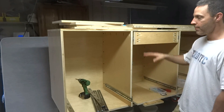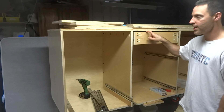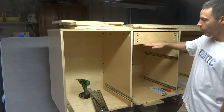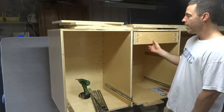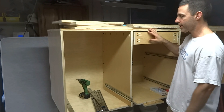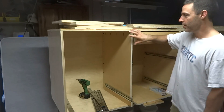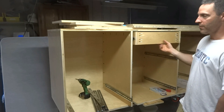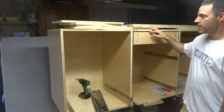I'm going to have three drawers, which means four total spaces. I decided to have a quarter inch of space between the top of the drawer and the top of the cabinet, the bottom and the bottom, and a quarter inch of space between each drawer. That's for two reasons: one, the plywood is dimensionally more stable than solid stock lumber, so it's not going to expand and contract as much. For now it's functional and it's going to work — it'll try to keep as much dust out as possible.